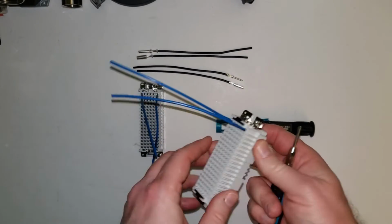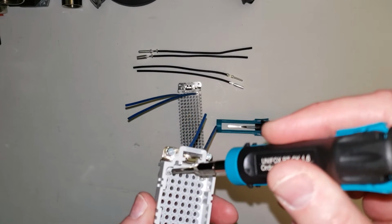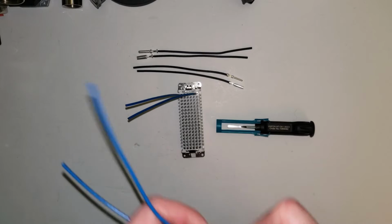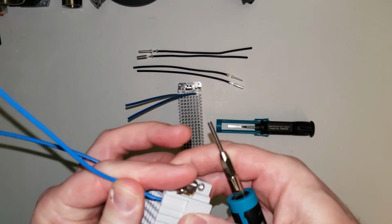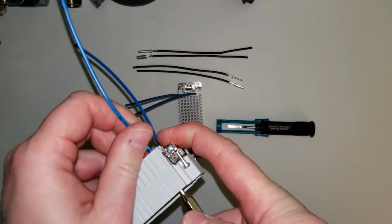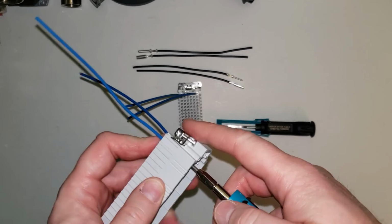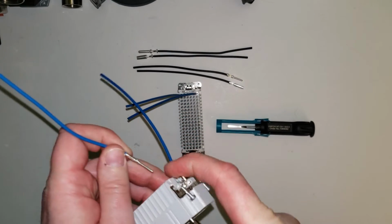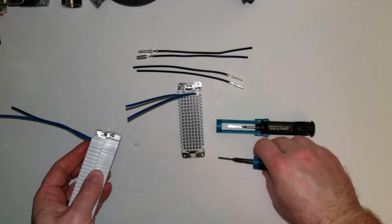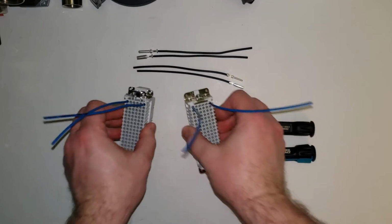put it in, and this works with our pin contacts as well, but instead of pushing down into the slot, it actually wraps around the pin contact, and then once it pops, let me try that again here and actually get it under the camera for you. Get that in there, get that onto the contact, and then give it a pop and it pushes out. One more time. And there it goes. So I'm going to put this back in, and there you have contact to contact. Those mate together, and you're good to go.